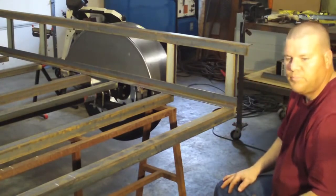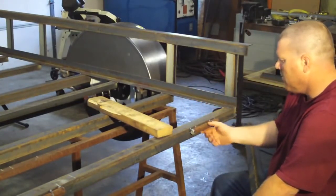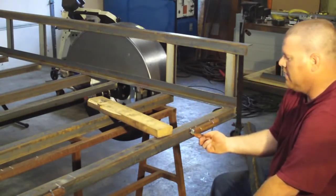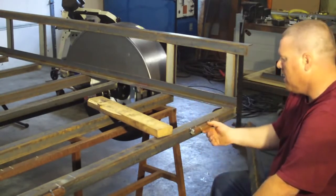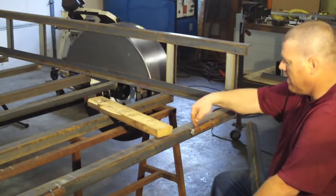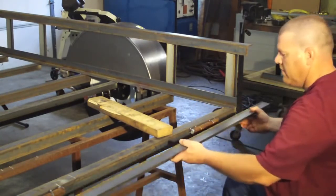We'll get to it. I wanted to talk just a second, now that I have the hinges tacked on, about welding, to make sure that you get it welded on the top and the bottom of the hinge. That way it's not going to be able to peel off or anything. And try not to get anything on the other one, you don't want to accidentally weld this one down. This one's only going to get welded to your ramp piece.